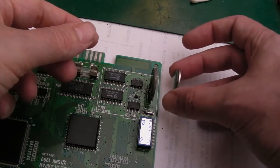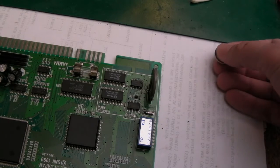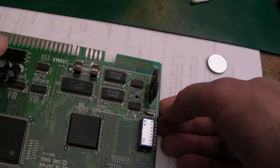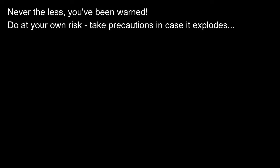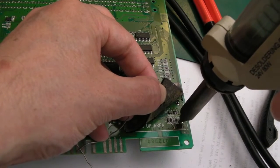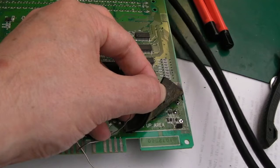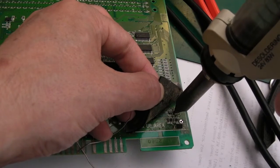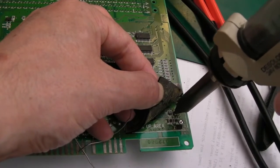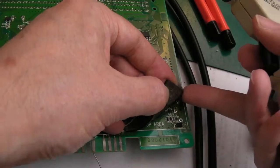Positive is on this side, so I'm going to solder this on. It measures four volts — I've got quite a few of these lithium-ion rechargeables. The thing I'm lacking is the little supports. I can't find my upright CR2032 holders, so I'll just solder directly onto this. There is a risk of fire when soldering directly to a lithium cell — it could get really hot — but that's very unlikely. Giving it time to soak through as it's quite a large trace.